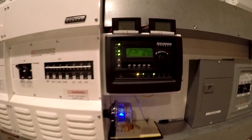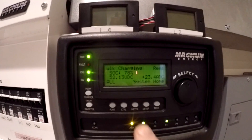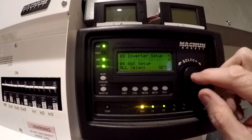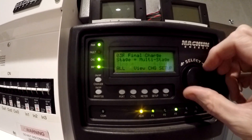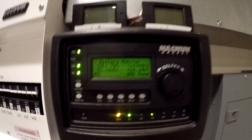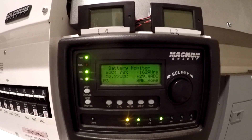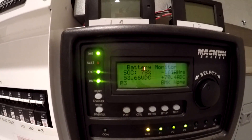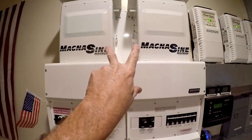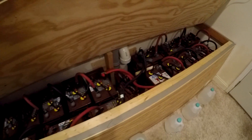Alright, we're all warmed up. I'm going to go ahead and crank this up a little bit so you can see that. Charger's set up and we're going to take it to 40 percent. We got 25 amps, it's going to crank up — you'll hear the generator. Alright, it's cranking up — 72 amps. I've got two 60-amp chargers and the inverters there, and all I'm doing is charging up this battery bank. That's the whole point.